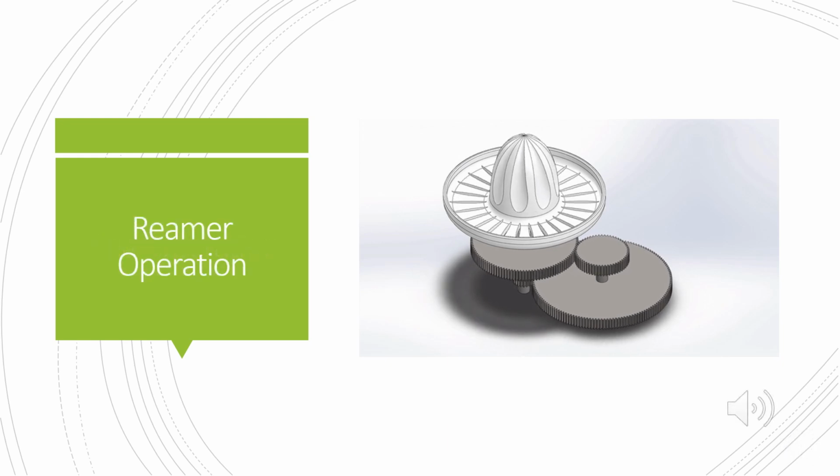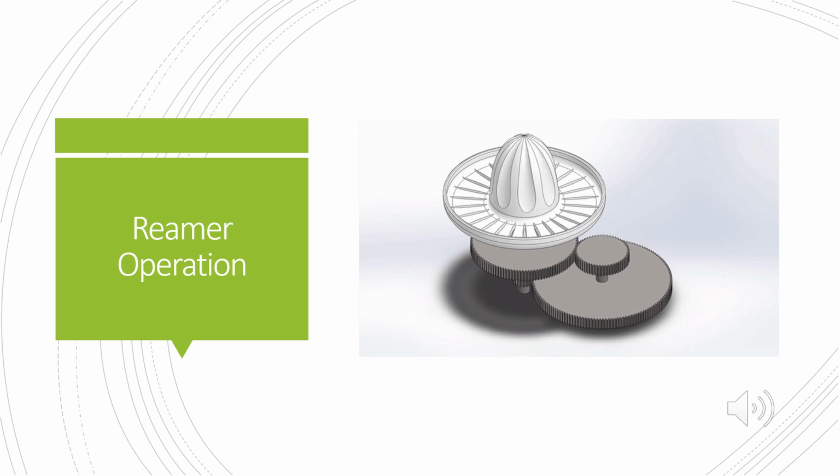The reamer that is in operation is a convexly tapered conical blade with deep straight troughs running the length of the blade. It extracts the juice from the fruits upon contact. The reamer obtains its rotational power as the shaft of the reamer is in direct contact with the gear that is linked to the motor driving the system. The conical aspect of the reamer that conducts the actual extraction of the juice is made of polyethylene plastic, which is considered safe in the food industry.